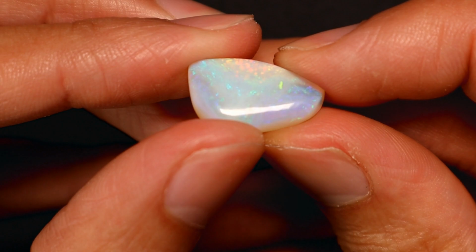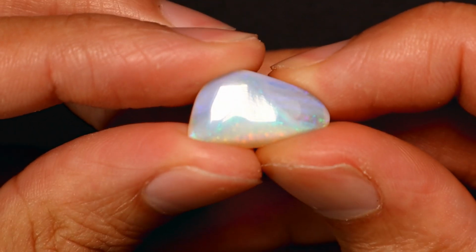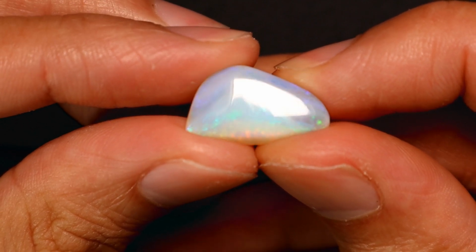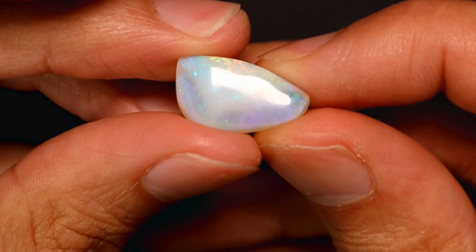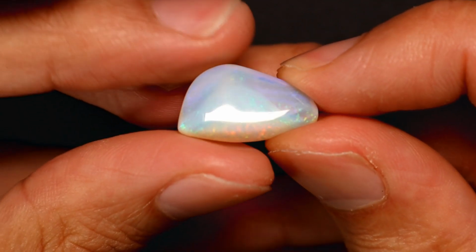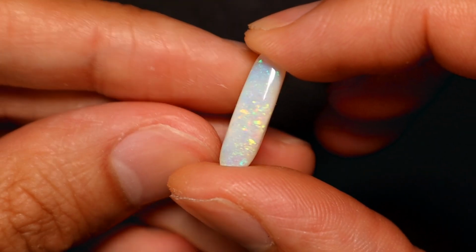And yeah, you can always use the light dancing across the face as a good way to check a lot of your polishing. I find that it's probably the easiest thing to do apart from grabbing a loupe, and you should probably do both. But this is a nice quick way to work out when you should stop. I'm just going to quickly tidy up this side a little bit and then cerium oxide it, and we will finally look at Famo's finished stone, which he can put alongside all these little bits of gold that he collected on the weekend. Alright, and here we are at the polished gem.